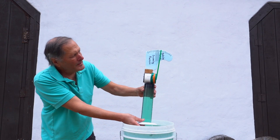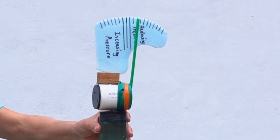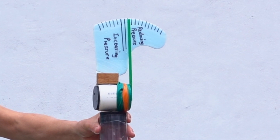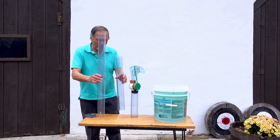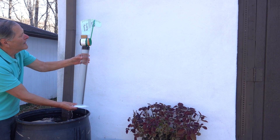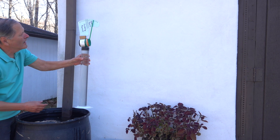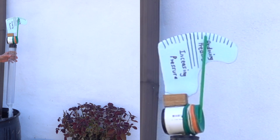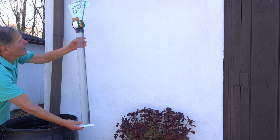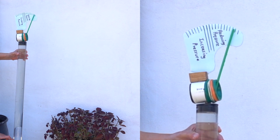Let's try it on a tube that's 10 inches long. It looks like the gauge marker moved twice as far on the pressure reduction side. Now let's try some cylinders that are even longer. This tube is 22 inches long and the marker moves about four and a half times further than the first one. This last one is about 33 inches long, and it looks like the pressure change is about seven times as much as the first one.